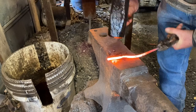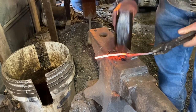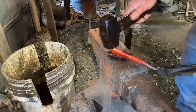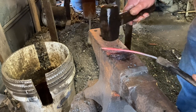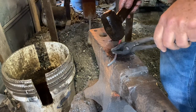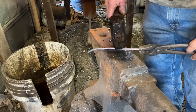Put it up and warm it back up. The first thing to do is just work it out straight. This spring is about 5160 high carbon, and since it is, I certainly don't want to work it too cold. It is cool out this morning and this is the first thing I've forged today, so the anvil is still cold and it's sucking the heat right out of it.